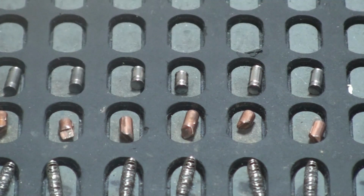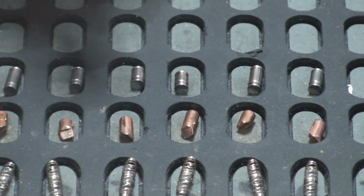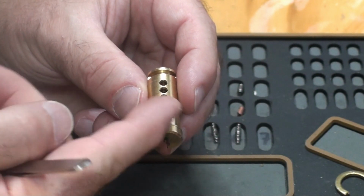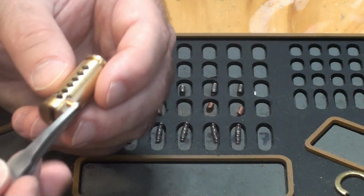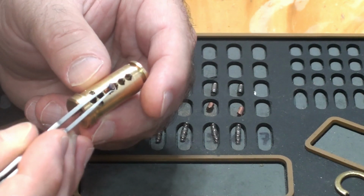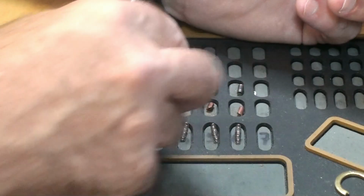Number one, it makes sure that no matter how high the pin is pushed, the wings never completely come out of the chambers. Okay, so you think about it. When you are inserting the key, all the pins are going to come up well above the shear line until they settle into their right positions. Now these little wings are designed such that you can never push a pin so far out that its wings lose contact and the pin rotates and jams. So that's the first thing about the position of the wings.